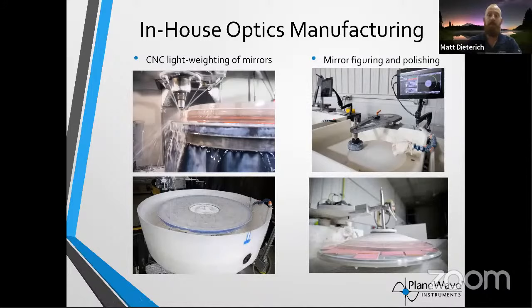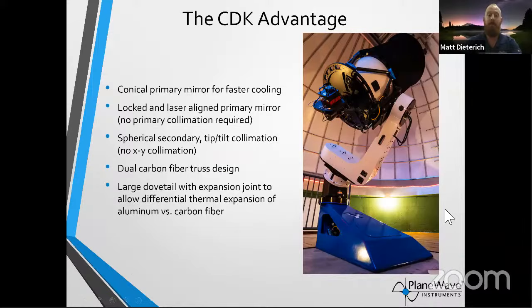These photographs show the behind-the-scenes: this is fused silica — quartz. You take pure white sand grains, heat them up, and that's fused silica, which you can eventually turn into glass. That's what these mirrors are made of. We figure the glass and take it down to the right shape — it takes hours and hours to get it there. Then we put a certain shape into the glass, coat it with aluminum, and do an overcoat to protect it, giving very high reflectance. That's the guts — the eyes of the telescope — all done in-house to keep quality as high as possible.